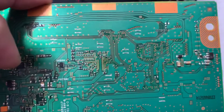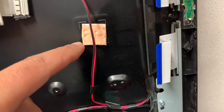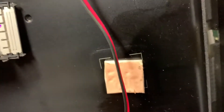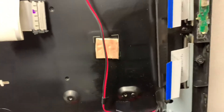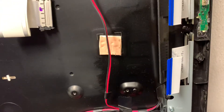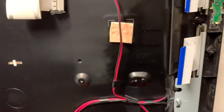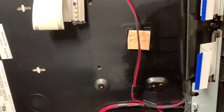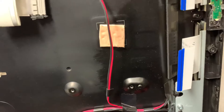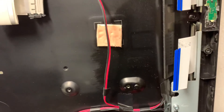I'm intending on replacing this T-CON board, and I'm also looking for replacement thermally conductive tape — I think it's about an eighth of an inch thick. So if you are in the same predicament, when you're changing the T-CON boards or any other board that uses this thermally conductive tape, make sure to change it and check for this sliminess and oil, because it's shorting out the circuits. Good luck.